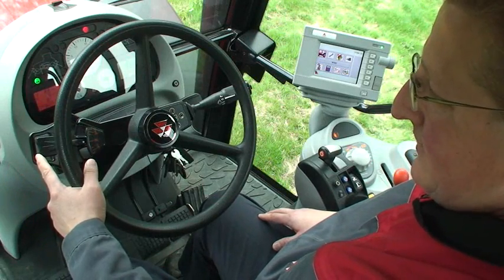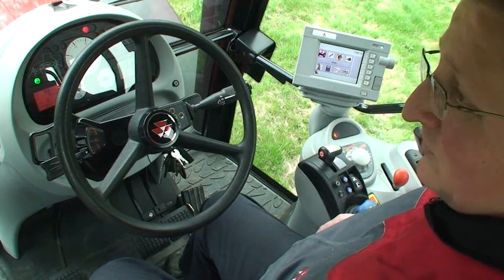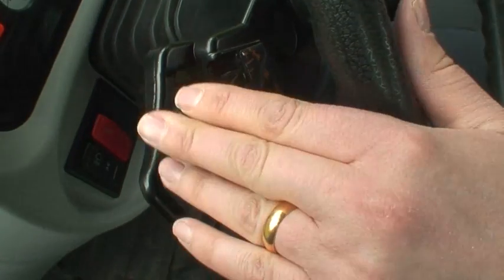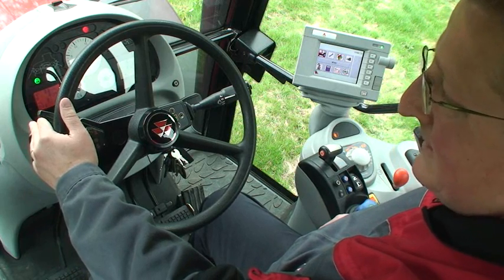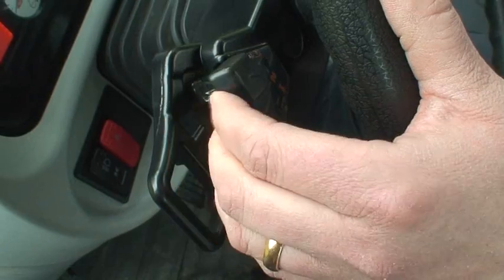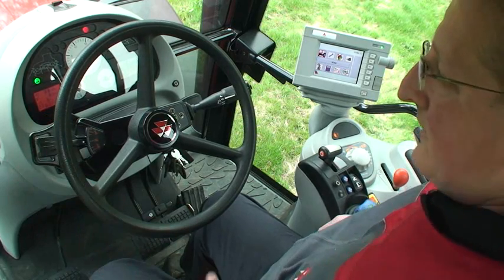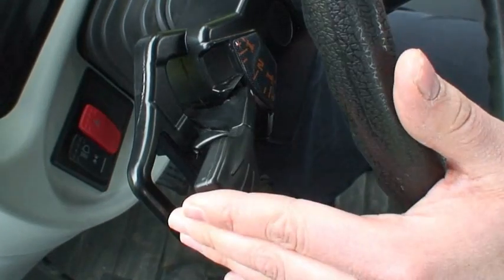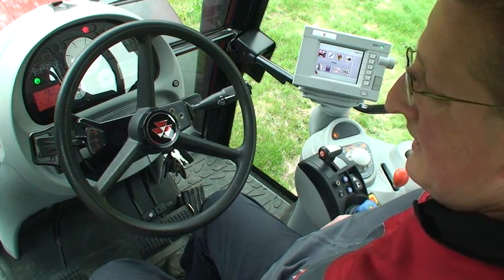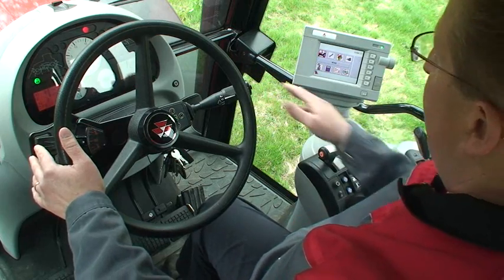The first of our controls to look at is the power control lever. This lever has a forward reverse shuttle. It also has a plus and minus for upshift and downshift to change our dyno-shift speeds and our gear ranges. The lever also has a fingertip declutch facility in forwards and reverse. The advantage of this lever to you, the operator, is it falls to your fingertips and is very easy to use. It also means that you do not have to use the clutch pedal and it leaves your left leg relaxed, and your right hand is free to operate other controls upon the machine.